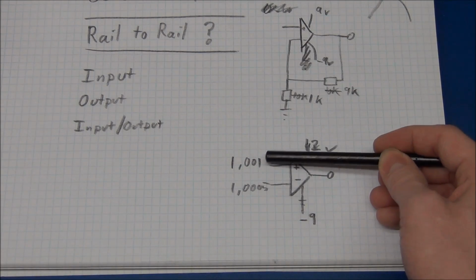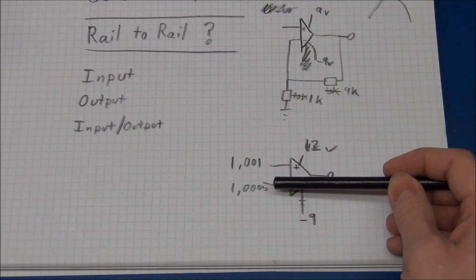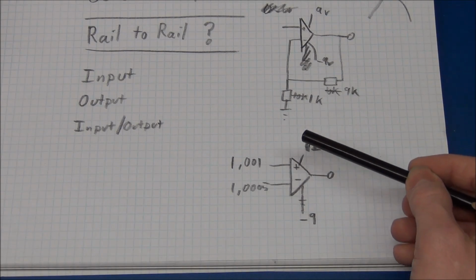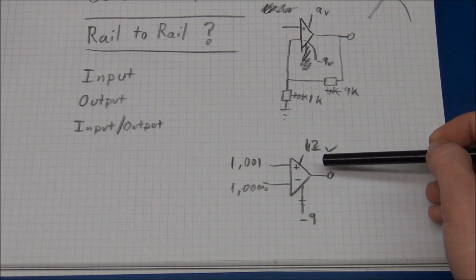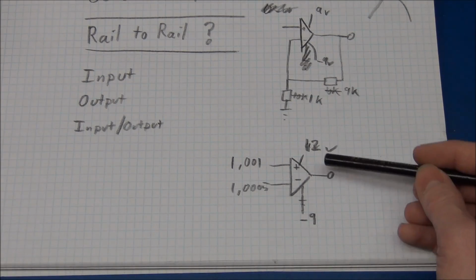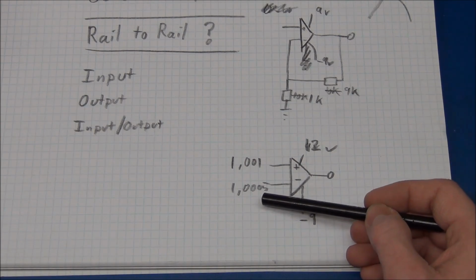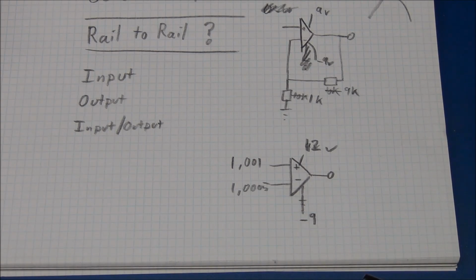But say there is an error of 500 microvolts, and that is nothing really. And that could be used for perhaps 95% of all you can think of. But if you have a very high gain on one of these amplifiers, then this input offset voltage gets multiplied as well. So if you have a gain of say 100, so now instead of 500 microvolts, we'll get 50 millivolts. So that could perhaps be a problem.